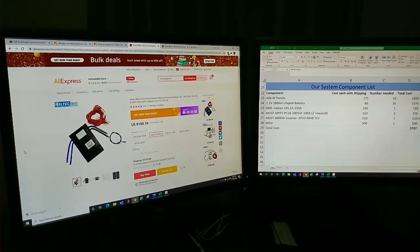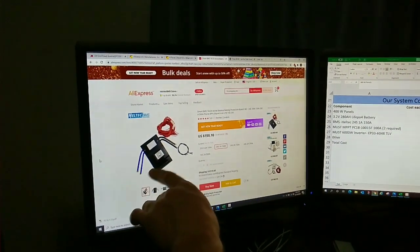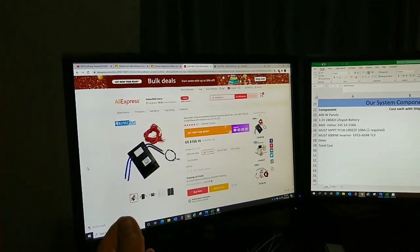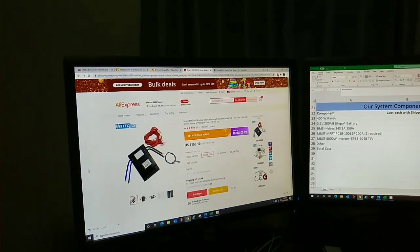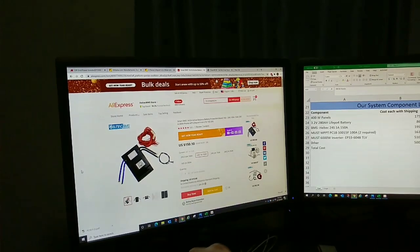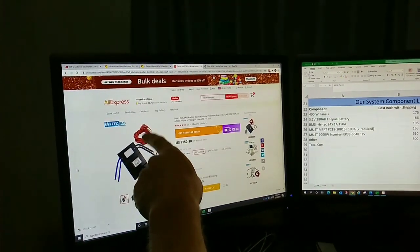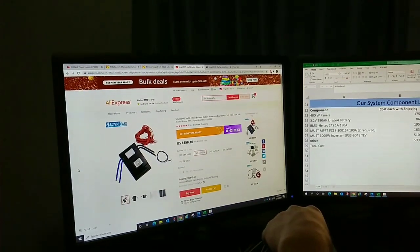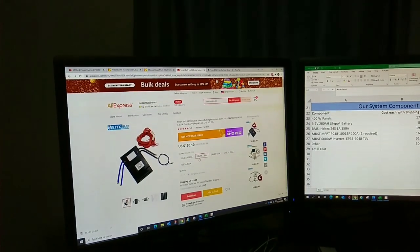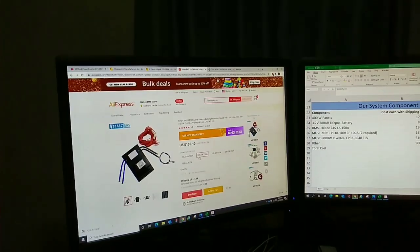Something you notice from the picture is that you have the BMS itself, and then you have your input and output lines, and then you have these smaller wires. I'm building a 48 volt system, so it has 16 batteries that are all connected in series, and this BMS will connect to each one of those individual packs. Here's the little battery harness so I can run wires to each one of my 16 individual batteries. That's what the 24 in the description means, that it'll do up to 24 in series. I only need 16, so it'll work fine.